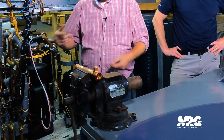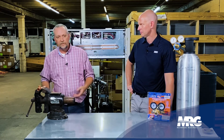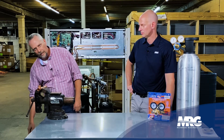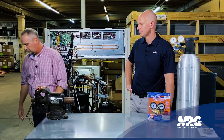So we'd have that set up, introducing dry nitrogen through there. I've got a little setup here where I'm going to make a couple of braze joints, but I'm going to do it without nitrogen to attempt to demonstrate the adverse effects that you can have on your refrigeration system — whether it be a residential split system, a VRV system with a thousand foot of pipe. What I always want our guys to have with them is fire suppression, a fire extinguisher. You need a water bucket. Not only does it help you cool your pipe down to move on quicker, but you may have to protect things around the piping — wires, et cetera. Good to have a bucket with a wet rag in it.